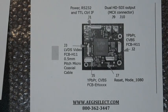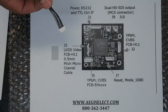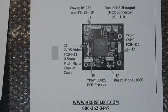Once you have your micro-coax cable connected to the interface board and your 24-pin flat flex cable, you'll want to move on to your JST type cables. We have J1, which is a 10-pin connector, and it is for power, RS-232, and or TTL control. This is a very important connector. There is an arrow on the spec sheet which identifies where pin 1 is of the board.